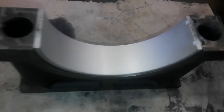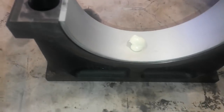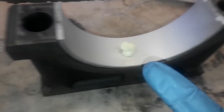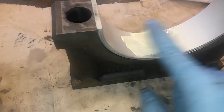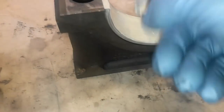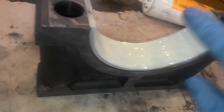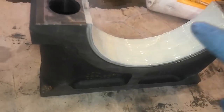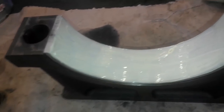On top of the bearings, on the bearing surfaces, you are going to put either engine oil or assembly grease. CAT recommends engine oil, but I always use grease, and so does everyone else. The reason is grease does not drip off — it'll stay there until you start the engine up. You don't have to put half a gallon on; you just need enough to cover the bearing and give it lubrication before the oil comes on. Just a little dab, then smooth it around. You don't want to get it on the sides or between the bearing cap.